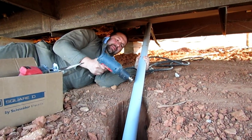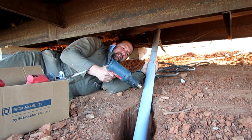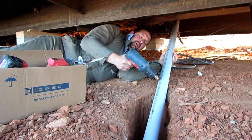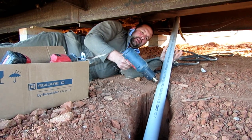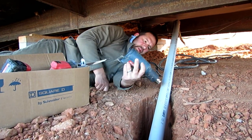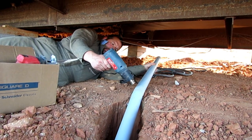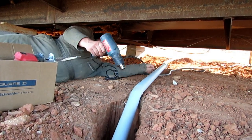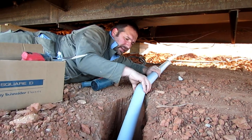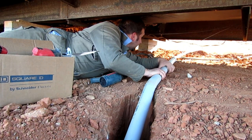What we've got here is we're just trying to make a little bend in this PVC so we can get it toward ground level. I've already chased the wire through it, and now I'm just heating it up to bend it a little bit. That's about as good as we're going to get it today — and that makes it lay really nice.